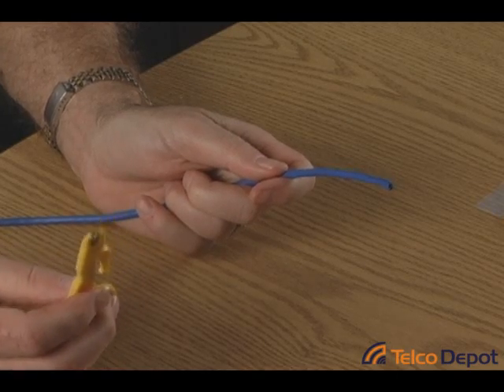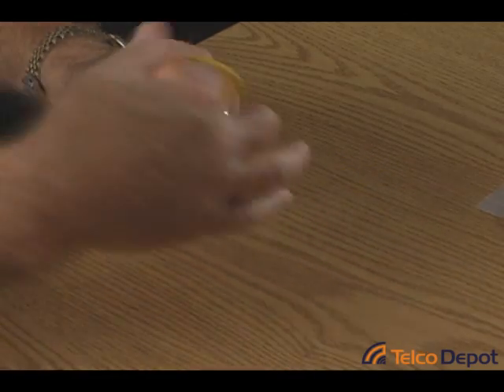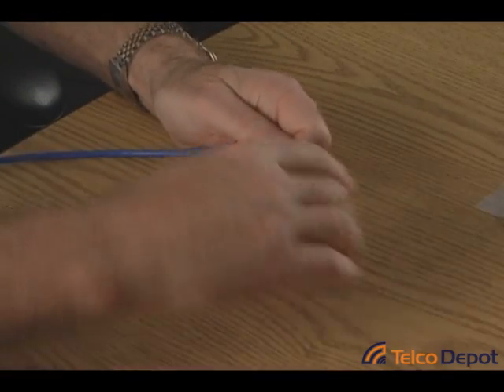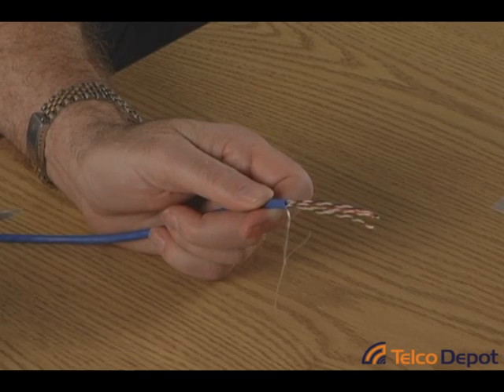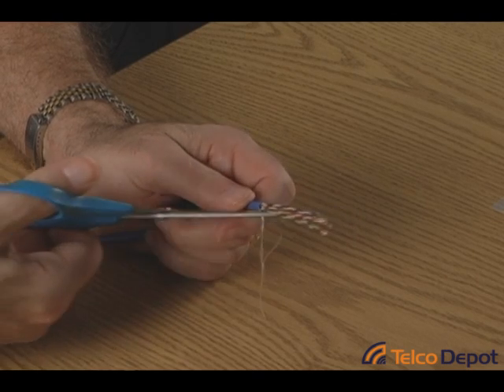This is an indispensable handy stripper. Just bring it around the end of the cable, a few twirls, the razor cuts in, and strips the end right off. You're going to want to strip some extra cable off so that you've got plenty of room to work, although we're only going to use about this much of it in the actual connection part. Now we're just going to snip off the strengthening fiber and get that out of the way.